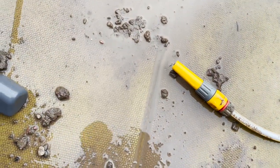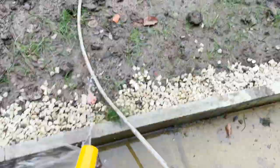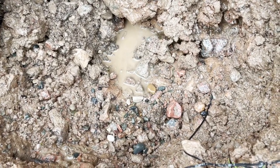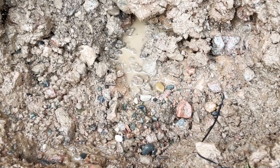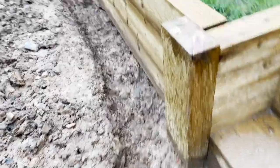I've just been digging and I've found a perforated drainage pipe — you can see it there. I also noticed an issue with my hose pipe — it's got a nice crack in it. But with this hole uncovered you can see it drains off pretty quickly, which tells me that drain pipe is clearly doing the job it's supposed to be doing and taking the water away.